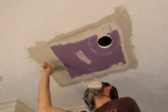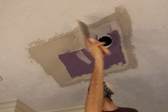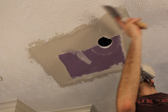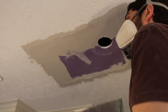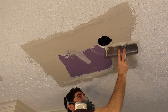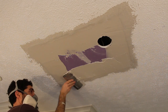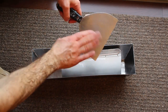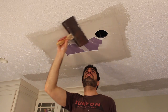I have half inch on one side of the joist and five-eighths on the other, which created a little problem that I share later in the video. I'm using Easy Sand 20 because it sets up in 20 to 30 minutes depending on temperature and humidity. I built up all four sides of the purple board this way — it's a bit of an art and I'm not a professional drywaller, but I do my best using a 10-inch knife. After each successive coating of joint compound, make sure you clean your knives and pan, and knock down any high spots.